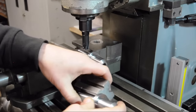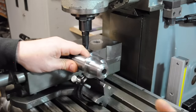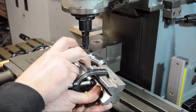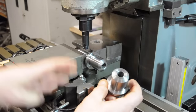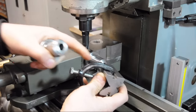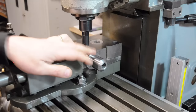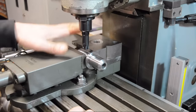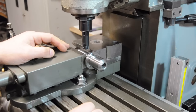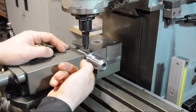Back to the tool holders. What I had done with the first tool holder was clamp it in a v-block, butt it up against one of the jaws, and mill in from the outside with the intention of flipping 180 degrees and doing the same thing on the other side to get those notches exactly 180 degrees apart. But as you saw earlier the clamp gave up the ghost and I damaged that first tool holder. Since these slots are pretty much non-critical, I'm just going to hold them rock solid in the vise, mill them, and eyeball them 180 degrees — I'm close enough to the bottom that I should be able to see the milling slot and eyeball it with the base of the vise.